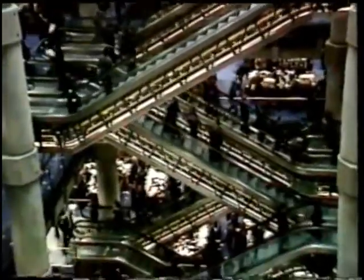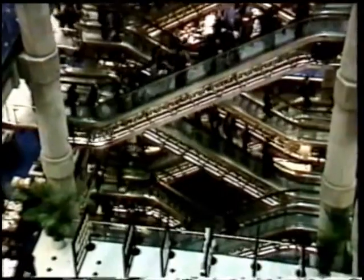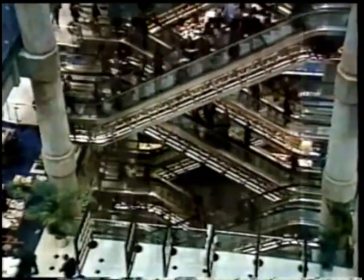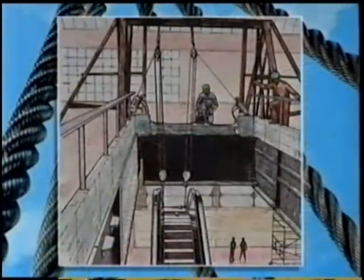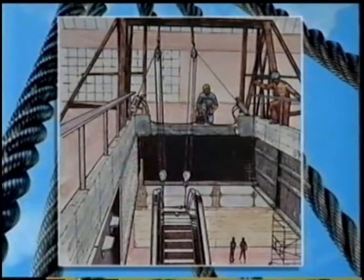Lifting heavy bulky escalators into position illustrates well the capability of powered Tirfors. Space is limited and cranes do not have access. There is a long height of lift and a requirement for precise final positioning, using multiple sheave blocks to increase capacity, and with all the operations of several Tirfor machines under the control of one man.